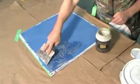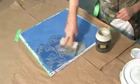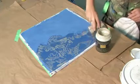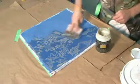Apply the top coat in excess to the surface area, then remove the excess top coat with a skimming motion. Repeat this process across the entire surface area. Do not be concerned about lap lines at this point.